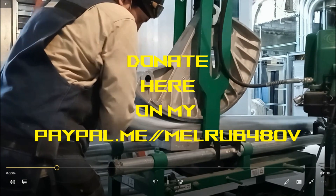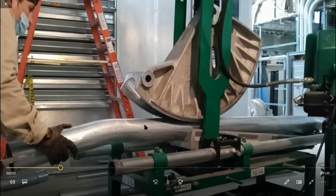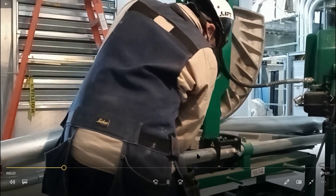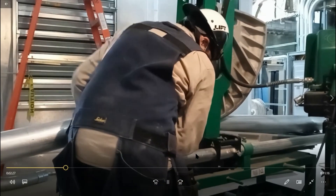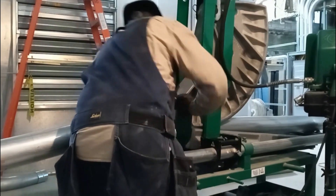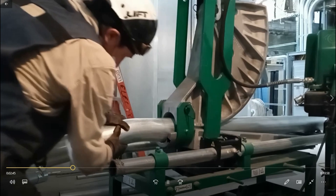It was a small bend, 10 degrees, didn't really make a difference — it wasn't gonna pull up the pipe too much. My pencil marks are really light. What I use to go around the whole conduit is the steam pipe fitter's wrap. You can use a small one; it gives you nice square marks around the whole pipe. You can also use your tape measure or whatever — just to give you a square mark. Here I'm moving it up to the beginning of the saddle, my next mark.